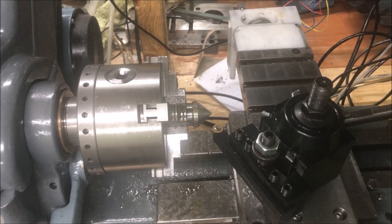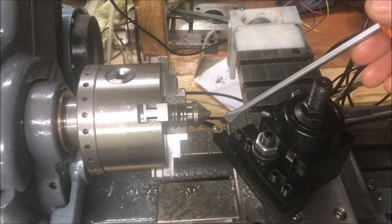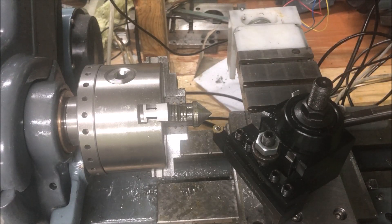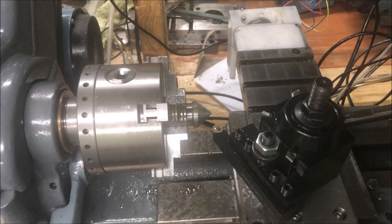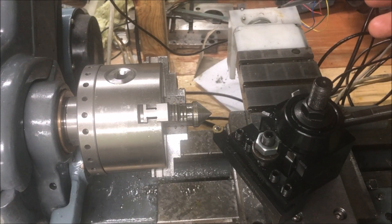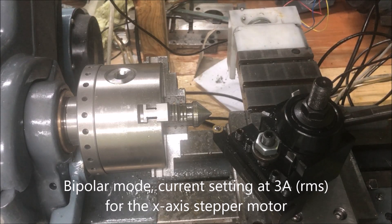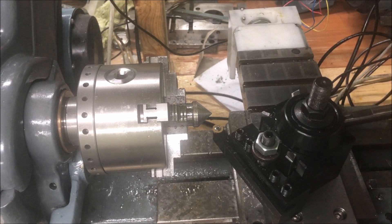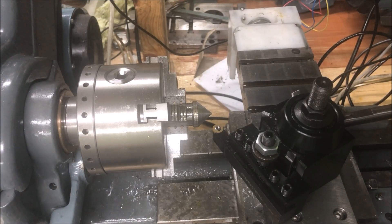Also, to be sure about the backlash. I had some error in the tool — I had actually degraded one part of the tool. Most importantly, the motor had a not correctly set current rate setting. So I corrected that. And lastly, I changed from version 10.11 to 10.16, which includes a new toolpath — a new program for the taper turning.